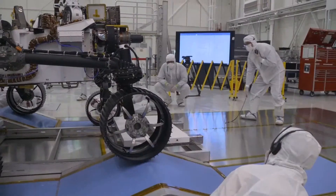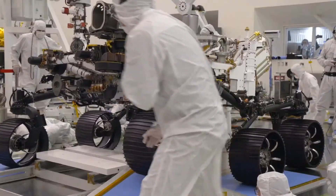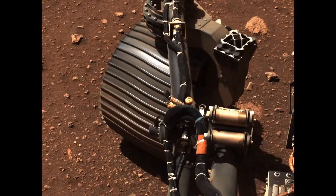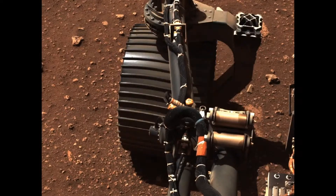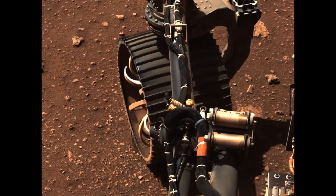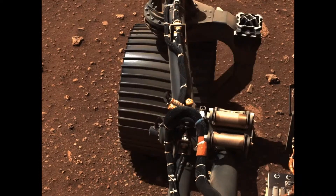That was just one of the things we did in preparation for our first drive. If we go to graphic A2, we also did a steer actuator checkout. Each of our four corner wheels was commanded through a 30-degree range of motion while we monitored motor performance and suspension angles. It went really well — in certain cases, better than we expected. We saw performance that in some cases was better than we've seen on Earth driving in the Mars yard. Whether that's from the underlying terrain or Mars gravity, we're not entirely sure, but it worked beautifully.